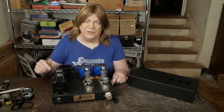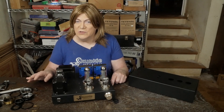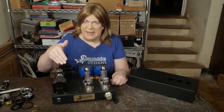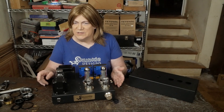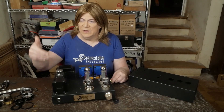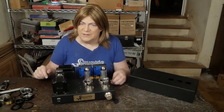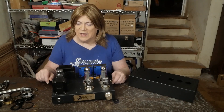Somebody asked why not use a 12AT7. That's not off the table, but 12AX7s are more common. You can also use 7025s, which are a low-noise replacement for a 12AX7 with a little less gain but plug into the same circuit. The gain on a 12AX7 is higher, so the input sensitivity will be lower — and there are probably a lot of people who'll try to drive this with a patch cord from their cell phone. The amp can't have real low input sensitivity and still make rated power off a low signal like that. I want to make sure even a DAC built into a turntable that isn't high output will still work with the amp.